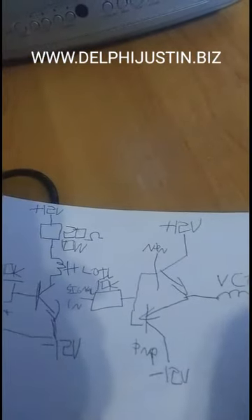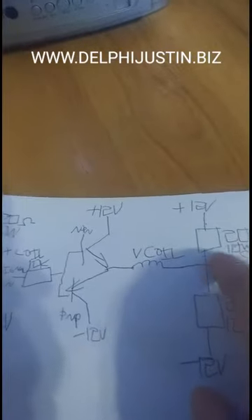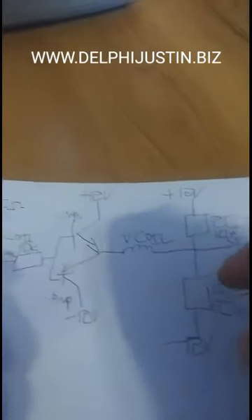You would have to play around with some resistors. You may not need 20 ohms for it. I tested it with a voltage divider - 100 ohms, five of them on each side, so 500 ohms on the bottom and 500 ohms on top, all in parallel, which gives you 20 ohms. They're like 3 watt because 100 ohms at 12 volts is less than 3 watts.